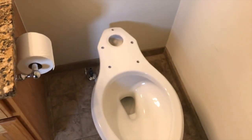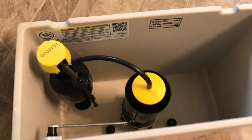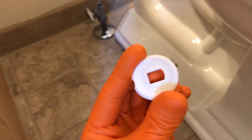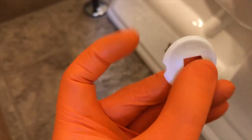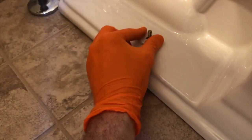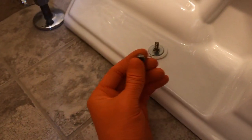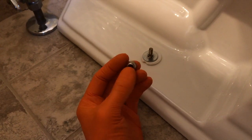Here's what it looks like so far. Next, we are going to open up the tank. Tank is out of the box — looks pretty nice, brand new. Let's add the washers and nut and secure it. This plastic washer says 'this side up' and in the pictorial image they have it facing out, so go ahead and insert that. Next, the metal washer and the new 7/16th nut. The old nut to the old toilet was a 9/16th, but this new one is 7/16th. Go ahead and insert it and secure it.